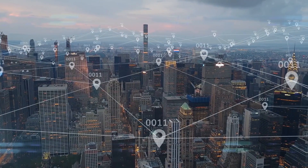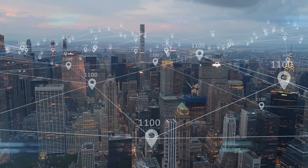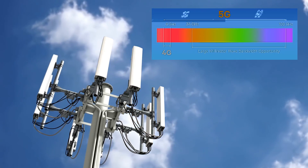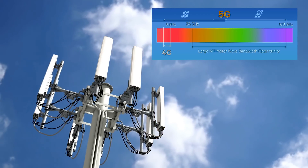Now there are a lot of people interested or concerned with 5G, which is kind of an all-encompassing term you hear a lot nowadays. Neither of these meters can read the full spectrum of 5G — I don't think there's any consumer grade meter out there that can, because 5G can range anywhere from 30 gigahertz all the way up to 300 gigahertz. With both of these meters, the max I can get is 6 gigahertz. So there is no way of fully testing the full spectrum of 5G. We're gonna do the best we can with the meters we have, so without further ado let's turn it on and get started.